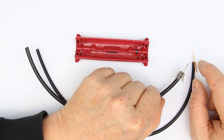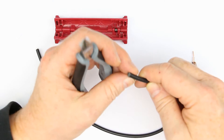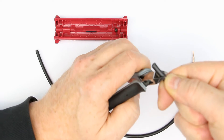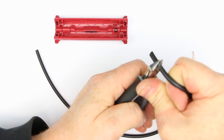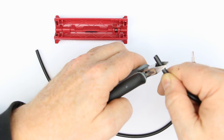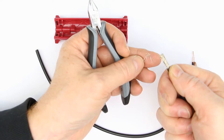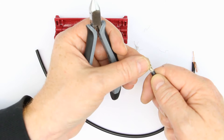You could of course try to strip the insulation off with a sharp side cutter, but it's not the easiest task. You have to turn the cable a few times around and then hope that — as in this case is not the case — it has cut not too deep but enough to strip the outer insulation off. And now you can see what often happens: some wires of the grounding have come off.